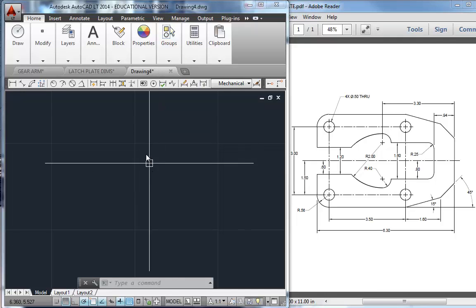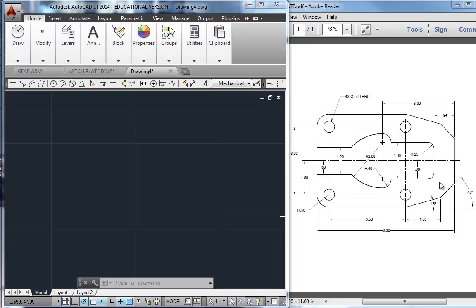Let's go into a new inch drawing and start creating this part. Notice the lower half and upper half are identical right through the center line — we call that a symmetric or symmetrical part — so we can just draw half of it and mirror it at the end to get the upper half. We're only going to draw what's below the center line. Notice there are no overall dimensions, especially vertically. The only thing we do know is this radius of 0.56 out from the center mark, so that means these tangent lines have to be that same exact distance away: 0.56.